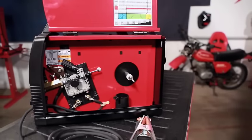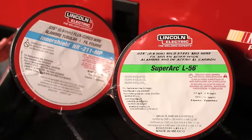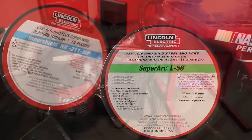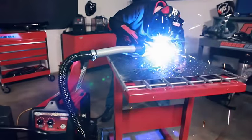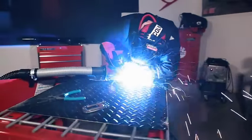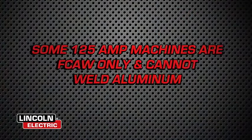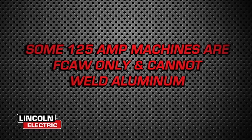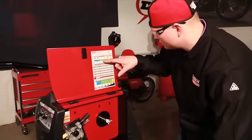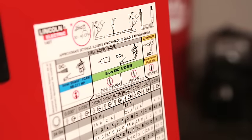It's been designed for workshop, hobby, and light maintenance uses — even light-duty general purpose welding with self-shielded flux-cored inner shield wire or solid wire with shielding gas. These machines can be used to weld low-carbon steels and aluminum with the FCAW and GMAW processes. Note that some 125-amp machines are FCAW only and cannot weld aluminum. For lists of wire types, sizes, and recommended shielding gases, look at the inside of the door panel on your Lincoln welder.